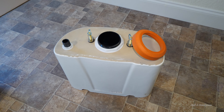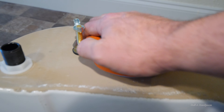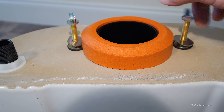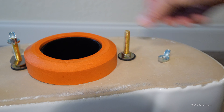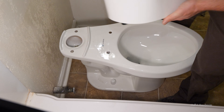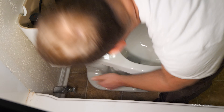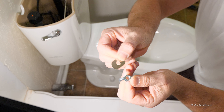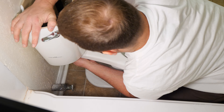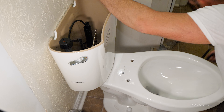Let's get the reservoir ready. You can pretty much tell where this big rubber gasket goes — just push it on down and make sure it fits snugly. We're ready to set it on the toilet. This is going to take two hands. Once you get it started, you're going to want to push down on each side to get this reservoir to actually touch the toilet. Right now it's being pushed up by that big gasket.